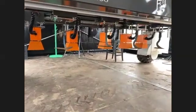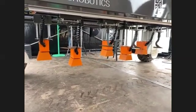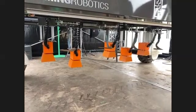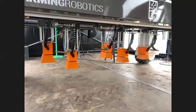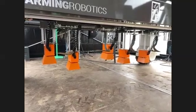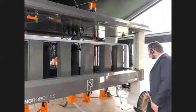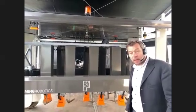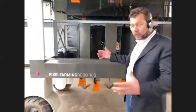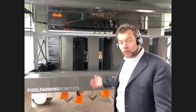What you see here is the arms moving together up and down. You can also move them individually and do the side shift individually per arm. That way, you reduce the time required to set a new configuration — for example, when you go from a crop lane of 50 centimeters to 37 centimeters, you can just do that automatically without having to reconfigure. It also means that when you use vision to exactly determine where the crop rows are, you can use this feature to configure it automatically. When you have the sides of an acre where you're not having the full three meters in sowed crops, you can automatically pull up two arms.